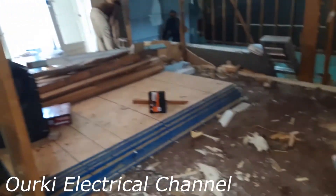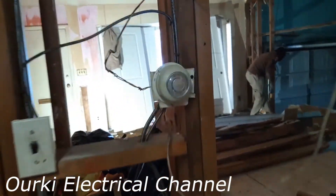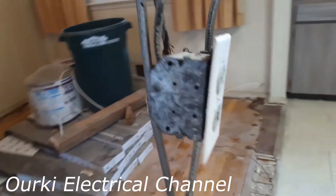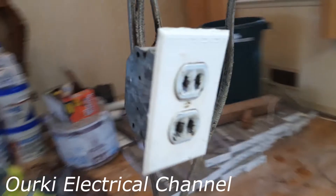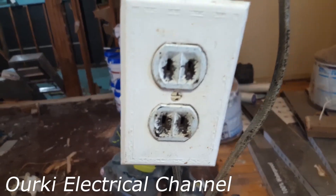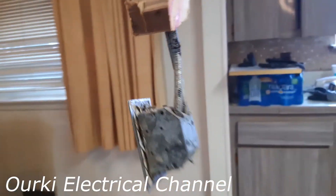This is the living room right here. We are going to do the renovation. We have to change this thermostat, change these switches, these old boxes. All the receptacles with two prongs — those two-prong receptacles are going to get changed to three-prong receptacles.